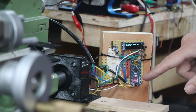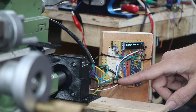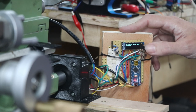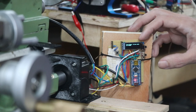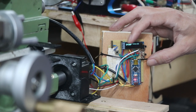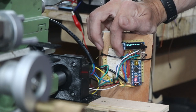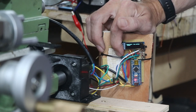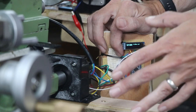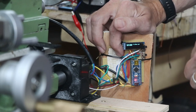This, of course, is the brains of the operation. We have an Arduino Nano. We have these three lines here as input sensors from the digital encoder. We have four lines going out to the stepper driver. And at the moment, I have the enable line and direction line as physical switches right here. You can just see on the screen the feed rate at the moment is 0.1 millimeters. I have one button to step the relative feed rate up through the various options — 0.7, 0.8, 1, 1.25, 1.5 — the main ones taking you from M3-ish up to M8, M10 kind of threads.